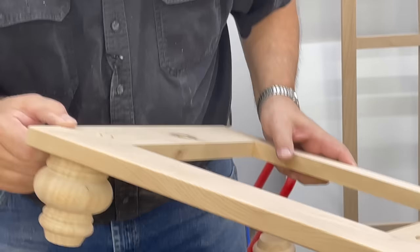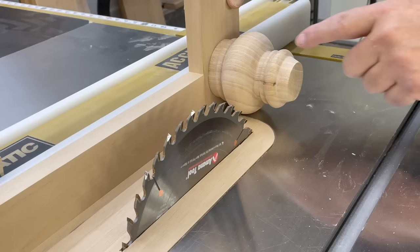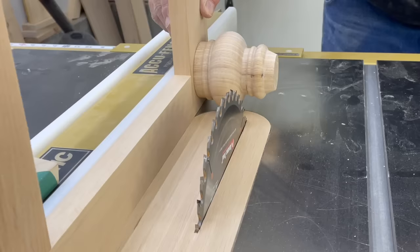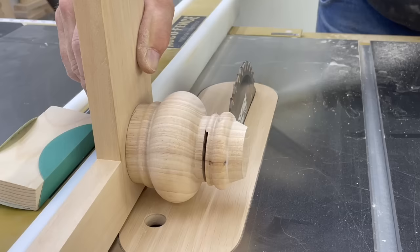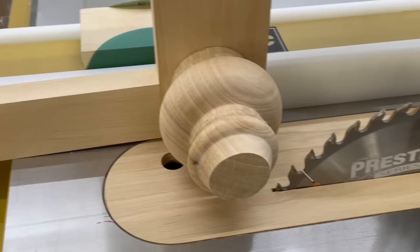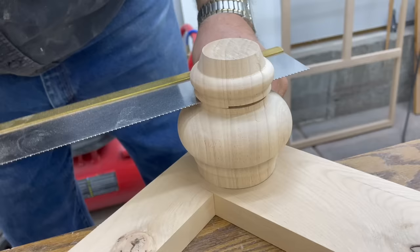These feet were a little taller than I wanted, so I'm going to show you a trick on how to cut something round — cut the bottom of the little foot off. Being round, it would be almost impossible to hold safely, even with a good chop saw and a jig. But by having it screwed to our face plate, I can run the face plate through the saw with the foot attached and get a nice square cut. The saw blade was set very high, so you have to really make sure you're safe — I didn't let go of my piece and I didn't put my hands in the way. It didn't cut all the way through, so we'll complete the rest of that cut with a little back saw.